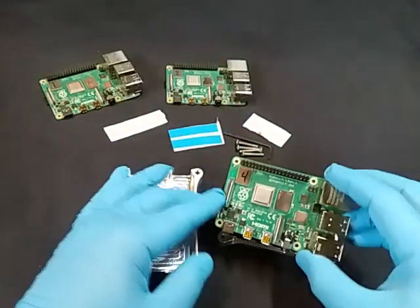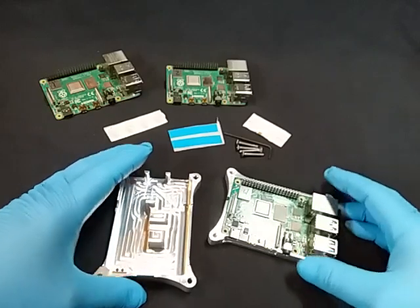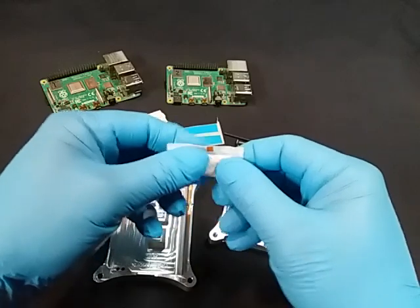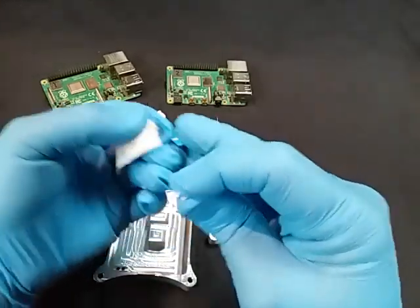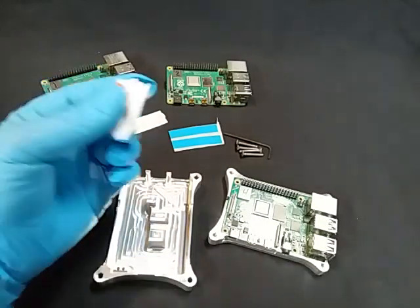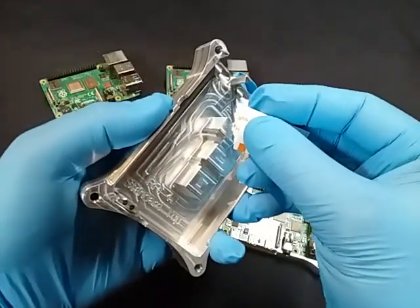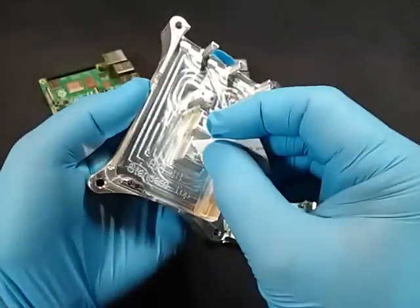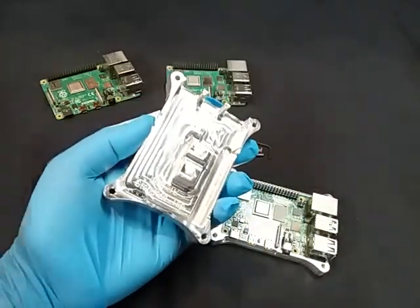Take your Raspberry Pi 1GB or 4GB and drop it in the bottom of the case gently. It'll line right up, and then grab your heat sink compound. I like to mix this up a little bit — sometimes it gets separated or there's some air bubbles in it, so mix it up a little bit before you use it. We're going to put a dab of it on each pillar here, in the middle of the pillar, and then we'll squish it down and make sure it's spreading everywhere. So we'll set that aside.